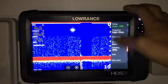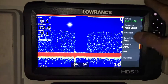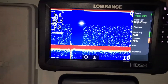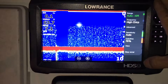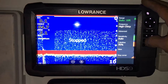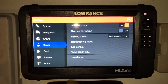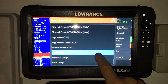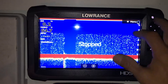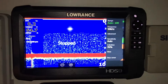Right now we're not in the water — we are in a driveway on land, so this is not an accurate reading. But nonetheless, you can see it's scrolling and water temperature is accurate. We're going to switch now from high chirp to low chirp. First thing we have to do is stop the sonar, then go into the menu: main menu → sonar installation → transducer.